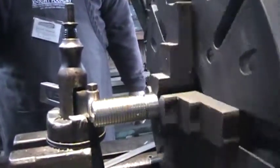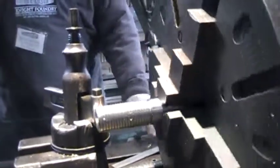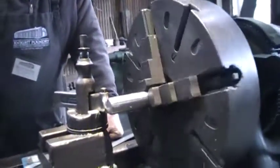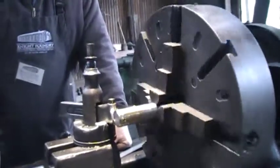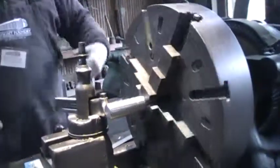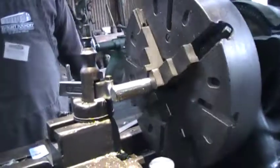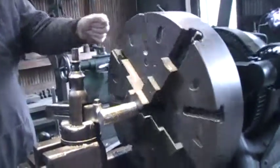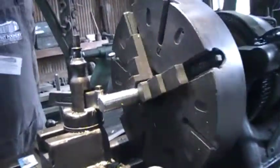So what do you take, five or ten thousandths at a time? I take it five. Five thousandths. One is for show, so I want this thread to last all day long. This is the way they did it back in the good old days. Plus, I've got a lot of breakage on the tip of the tool here — I think these things aren't as rigid. It's an old machine.